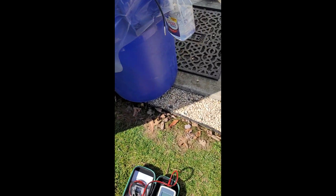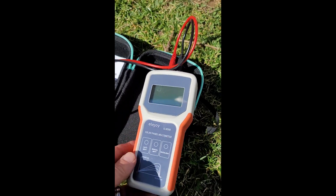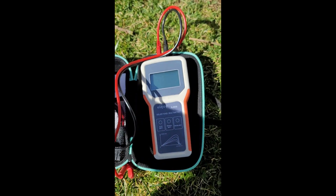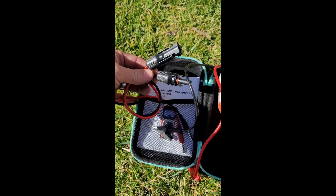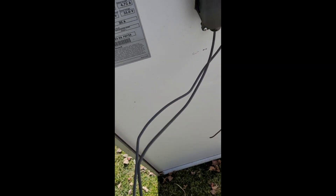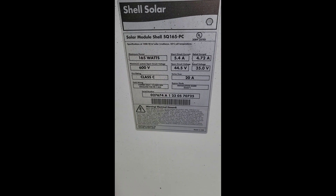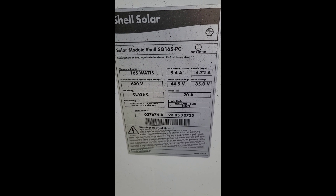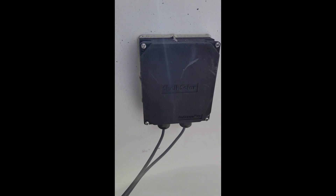So let's get to the tools. What we ordered was an L-Joy solar panel multimeter. It's got MC4 connectors on it. But this particular panel — somebody when they pulled these panels off went ahead and snipped all the cables. No big deal, we're just gonna rewire these if they're any good and put MC4s on there. There's the label: Shell Solar 165 watts, 44.5 open circuit voltage, 20 amp. Let's find out how close these things are still reading.